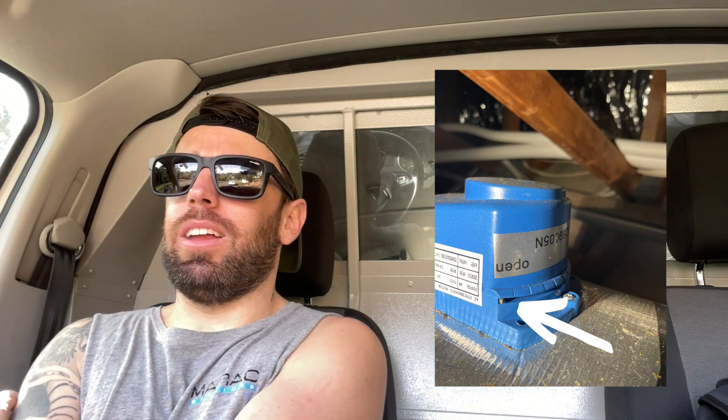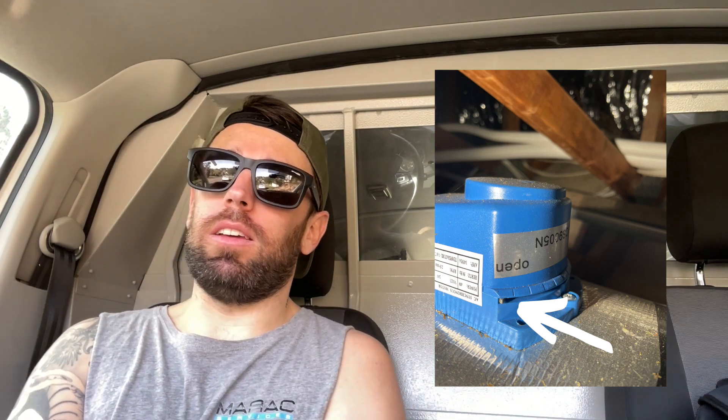I jumped up in the roof and he had a zone motor with two 14-inch ducts going off — a 14-inch zone motor on each. Zone motors have a tab which tells you if it's open or closed. On the downstairs one, that tab wasn't there — it's just gone. The customer stuck his head up the manhole behind me and I said to him, 'This one doesn't have a tab, I don't know if it's open or closed.'